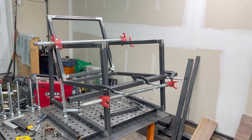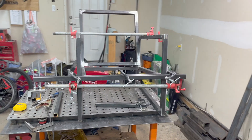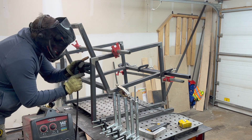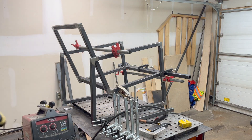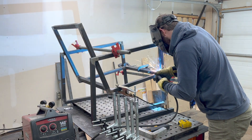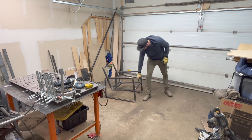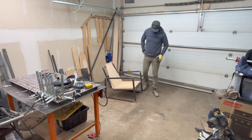The next part of this build is to get the two sides connected to the seat and back. When doing chairs of any sort, this is the part I struggle with most — making sure that it's going to be comfortable enough to sit in. Getting everything set so that the armrests aren't too high and the angle of the seat and back isn't too upright or too laid back. Once everything is set and I'm satisfied, I use a bunch of clamps and some extra steel to keep everything in place while I place a few tack welds at various spots. I grabbed a couple scrap pieces of plywood and MDF to mimic a seat and back to test comfort — turns out it's pretty darn comfortable — so I brought it back to the welding table and finished up the welds.